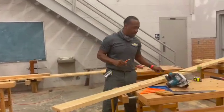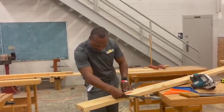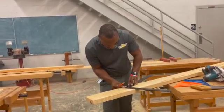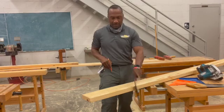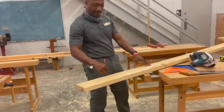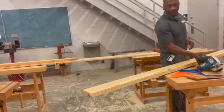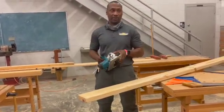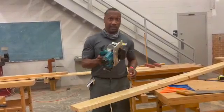So now this is where my square comes in. I'm going to take my square, line it up with that angle, and line it up at the edge. I've got my little bird's mouth beak marked — that's what I'm going to cut out. Make sure while you're doing this that you don't engage the saw accidentally — you've got to push that guard down, then do that.